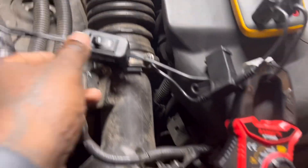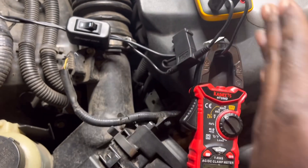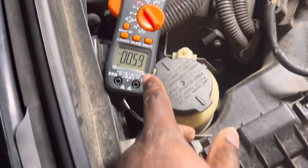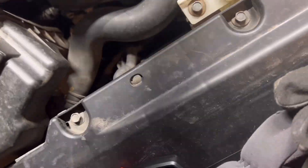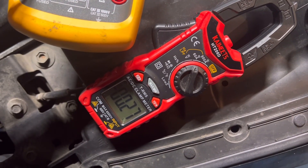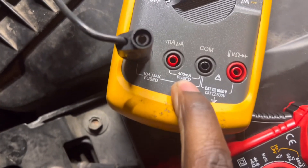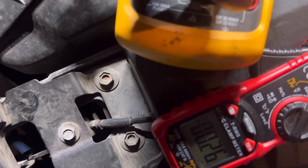So I turned it off. When I turn that off, it keeps the current from coming on this side. The processor is still showing like 37, 300-something milliamps. This one hadn't changed because it's before it. But the Fluke goes straight down to zero. Now I'm going to plug it into my Fluke 87. This thing has resettable breakers in it. I've got to go with the amps because sometimes it's more than the max of 400 milliamps — especially before all the computers and stuff go to sleep.